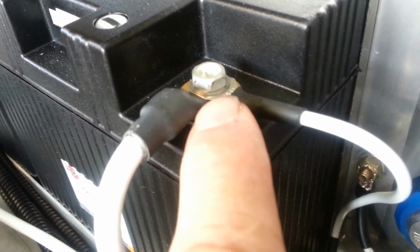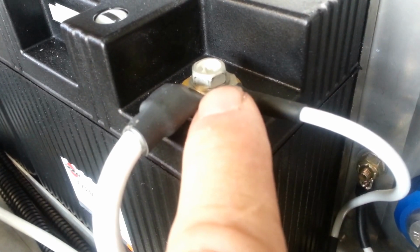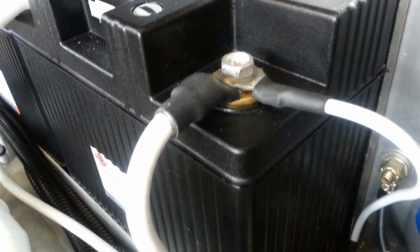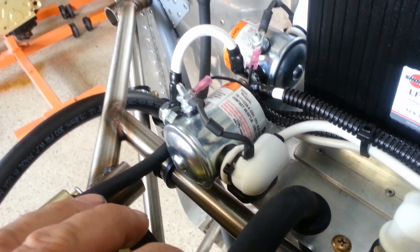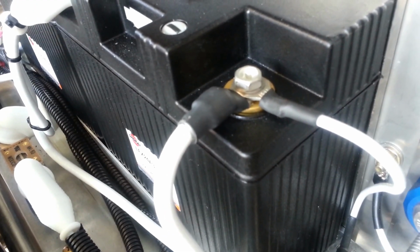All terminals are crimped using a special crimping tool that is designed for it. Every single terminal has the right size for the bolt and the right size for the wire. You want to buy a whole bunch of them that have a 1/4-inch hole that goes for all the 6mm screws on the engine. You want a whole bunch of them that have a 5/16 or 8mm hole that goes on all the big lugs on your contactors and so forth. And you want them assorted for either number 6, number 10, or number 8 cable.